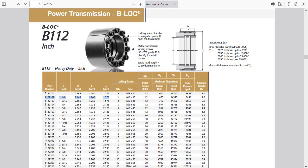Six bolts, which is going to match something I'll show you in a second. A lot of these cheaper ones, when we get into the torque specifications — how much they can hold before they slip on the shaft — most of them are like 340 or 360. This one is 675, and the 1-inch is 600. So these are heavy duty, and they're a pound. You don't really save any weight — at most a quarter pound by going to a lesser unit, but you're going to lose a lot of torque capability.